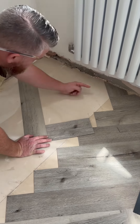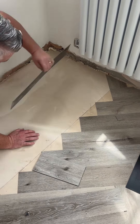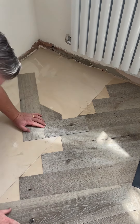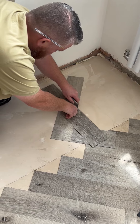So you've cut your first piece around the perimeter with your herringbone flooring. I'm just going to show you a really easy technique. What we're going to do is get that little L-shape — this piece that I've got, that's half a plank — and it imitates the piece that's already installed. Then we simply just straight edge along the top.